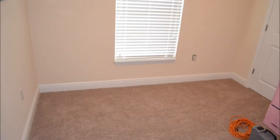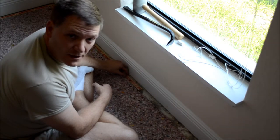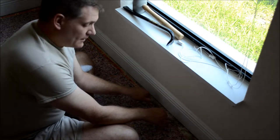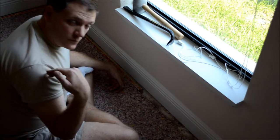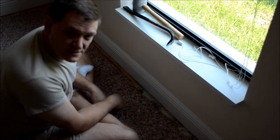On to the video — enjoy the show. If you've never pulled up carpet before, 95% of the time these houses have a tack strip holding the carpet down. Come out to the middle of the wall away from a corner, grab the pile of the carpet, give it a little push towards the corner or towards the baseboard, then lift it up off the tack strip. You can do that all the way down and just fold it back from the wall. I'm keeping the pad in place while I'm working here because it's a nice soft surface to sit on.